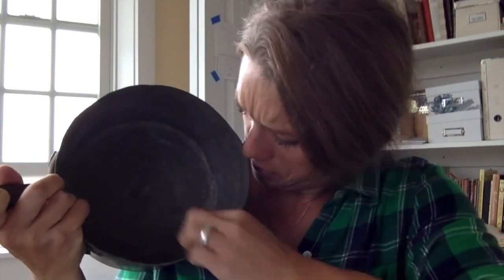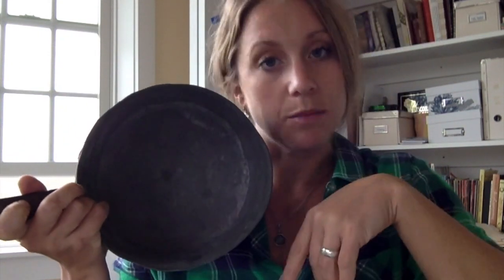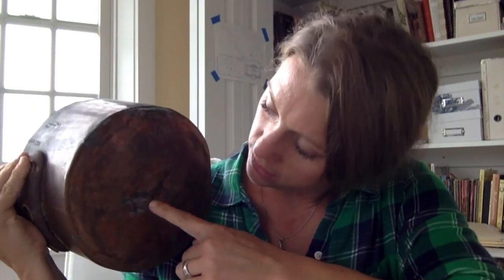This one has even more issues. See the verdigris all along the base — it's cracked and leaking. This is a leaky pot. To fix it, I'll have to completely clean off all of the verdigris. There's also extra solder right down here where somebody tried to repair the leak with a chunk of tin — that never works; it will eventually just continue to leak. There's also a huge crack that went all the way through in the middle, which will need to be fixed by completely cleaning the metal and then using an acetylene torch, brazing sticks, and brazing flux compound to repair it properly.